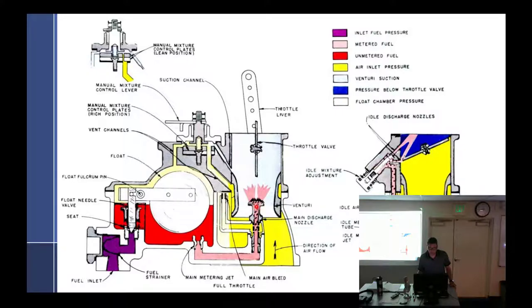Fuel level's right above there — if it's not, you're going to get it leaking out. So what does it do when you're running? Does it still leak out? Yeah, it just goes inside. So what is that going to make the mixture? Rich — because there's too much fuel. Part of this whole rich-lean thing is a function of float level, which is a huge part of it, plus the main metering jet has something to do with it.